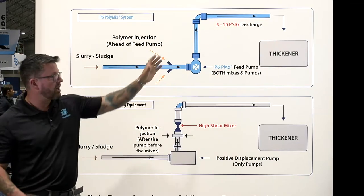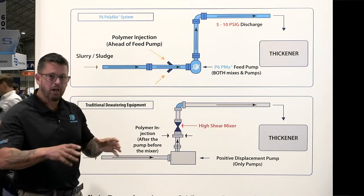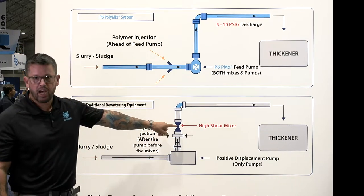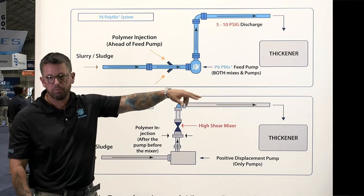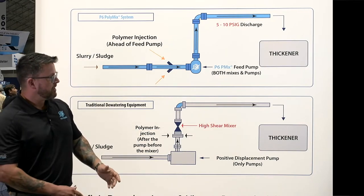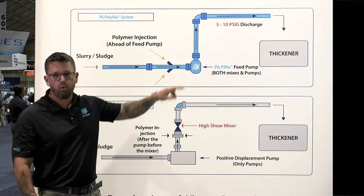In addition, there's potential for dryer cake on the back end because you're optimizing your system. The industry puts a lot of money, science, time, and energy into developing very good belt filter presses, screw presses, and dilute neat polymer systems — and then shears the heck out of it with the high shear mixing valve. That completely goes away. Now we're doing it at low pressure, the pump does the mixing, we're reducing polymer consumption, and customers are seeing one to four percent dryer cake on the back end. Because of our boundary layer viscous drag principle, we offer up to a 20-year wear warranty on the pump itself.